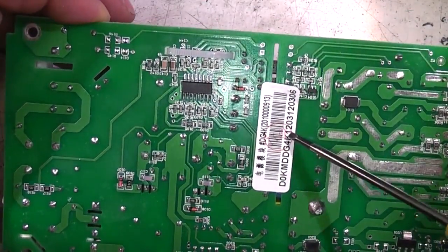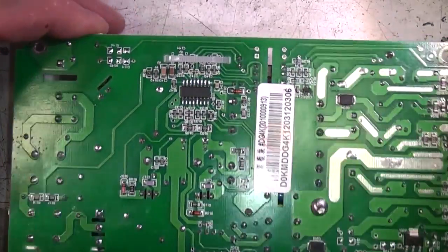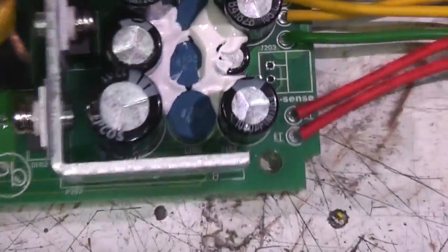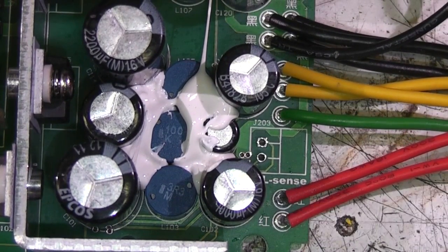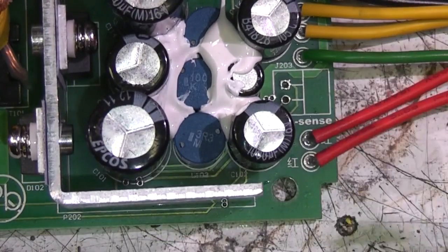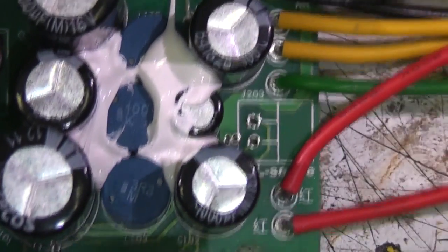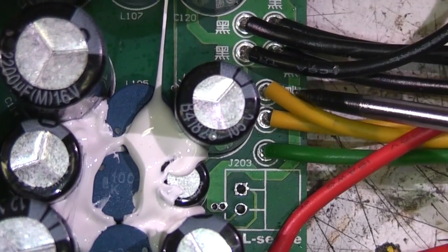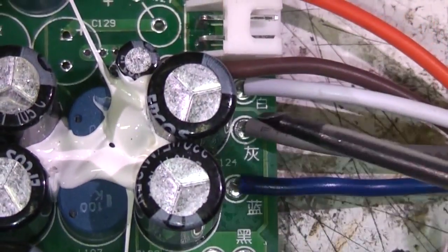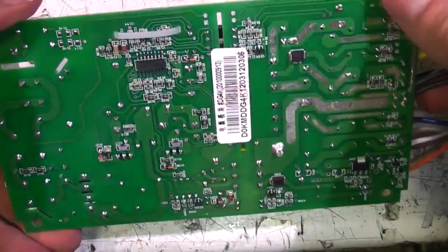I don't like the fact they've got a label in the high-voltage area — it's a plasticky label but it's not ideal. I think that's a very minor quibble. Other than that I really can't fault this at all. There does seem to be quite a lot of connections, with a sense feedback from the main supply. One thing you don't often see is quite a few of these pads are actually labelled in Chinese — you very rarely see that on PCBs. Maybe someone viewing can give us some translations. There's a connector for the fan. The build quality is as good as the rest of the unit.